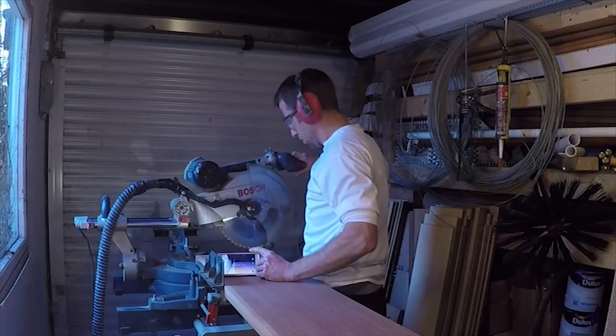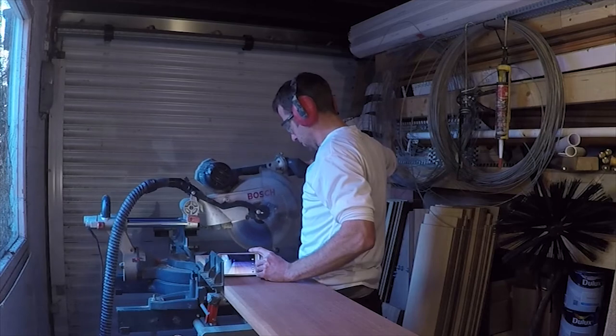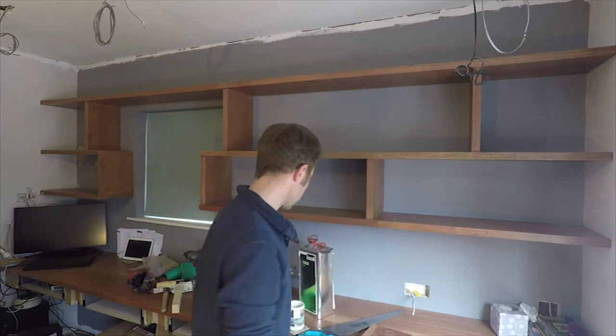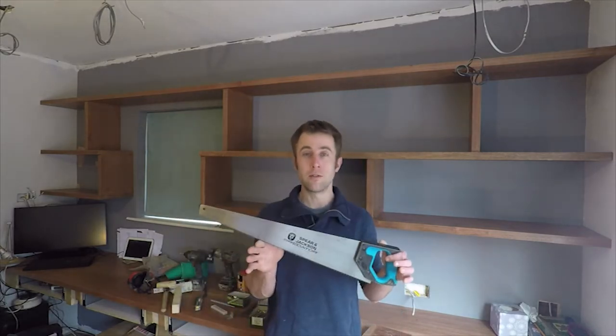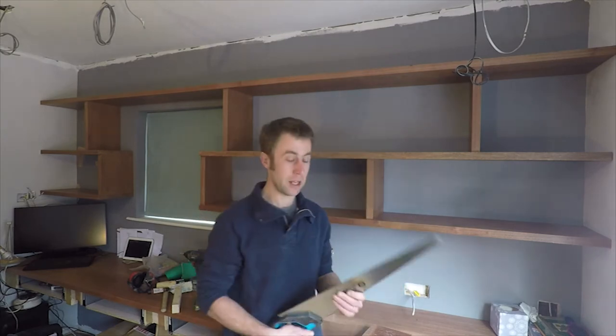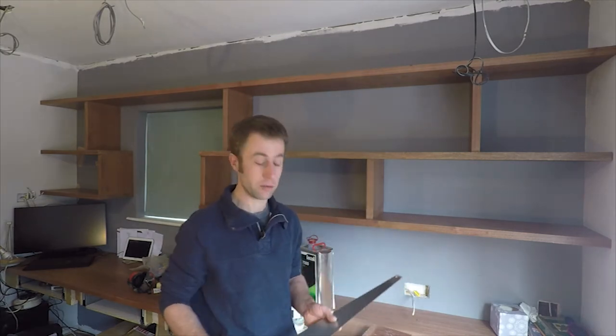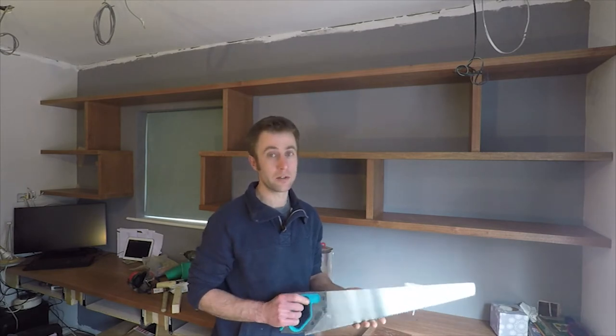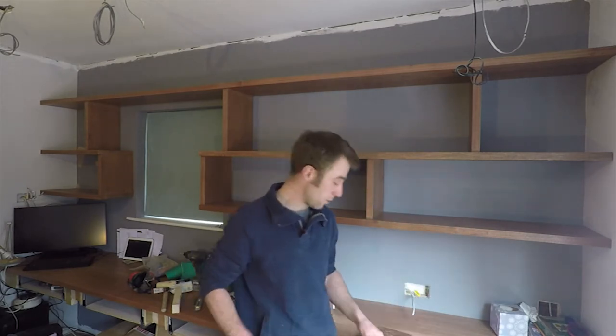To cut the wood, we're going to need a chop saw. This one's quite an expensive one. You might not want to buy one just for the sake of making your shelf wall, so you can go and hire one. If you haven't got a chop saw, then just resort to the good old saw. Do yourself a favour, just buy a new one. They don't last. Don't cling on to the old rusty ones, honestly. Not only does it make it harder to cut the wood, it produces a much worse finish. For your saw, you want to have a nice, neat finish.